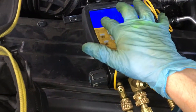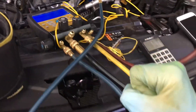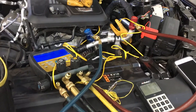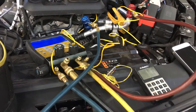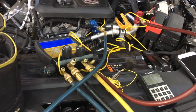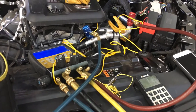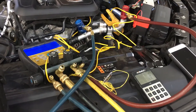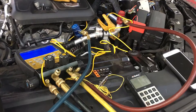I've got it down to 127 microns right now. But what do you notice that is kind of odd looking? Some of you may have seen this on a different vehicle a long time ago, but most of you probably have not. Look really closely — what is odd here, what is different? Look at the high and low side fitting.